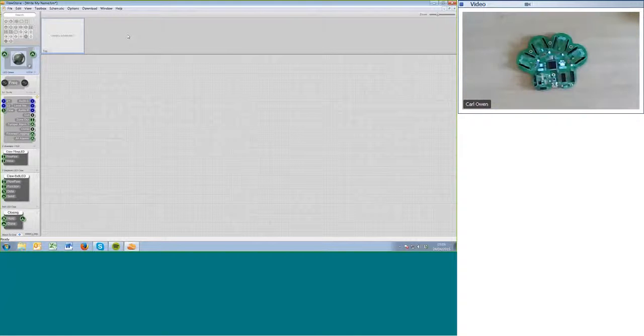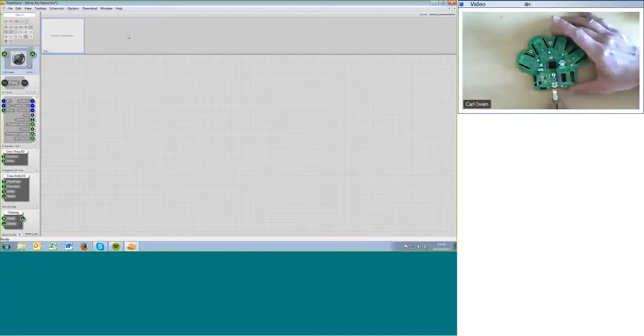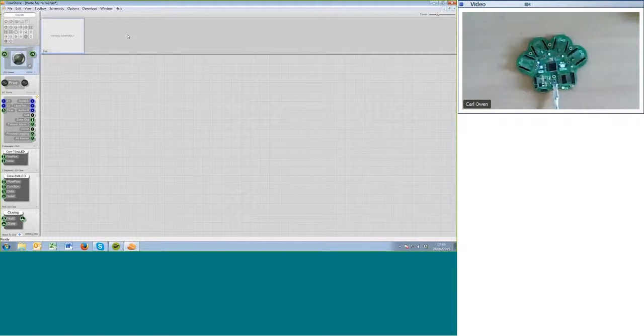To connect our FlowPaw, it's quite simple. We just plug it into the USB of your PC, on a USB 2 port preferably, and the computer will automatically find the board. There are no drivers necessary. Once it's connected, you can see these 4 LEDs flashing to say I'm alive, and we are now able to connect to the board.